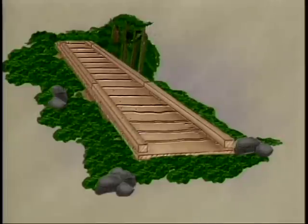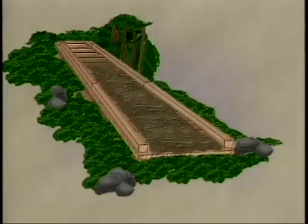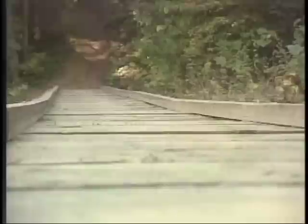Soil from the excavation should be piled in the middle of the stringers to help keep this section wet. The tread surface between the curb logs on a subsurface puncheon should be filled with a layer of gravel, wood chips, or soil.